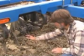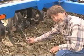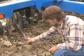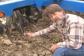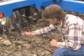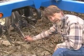Therefore, when this tine is operating, as we'll see in the hole, there is no residual compaction forces left behind the insertion and withdrawal of the tine. This is because the soil, which if it were parted in the opposite direction would remain undisturbed — as is the case on some competing technologies — this tine removes any of the compression forces that have been placed in the soil during the entry phase.